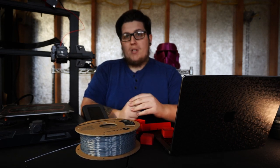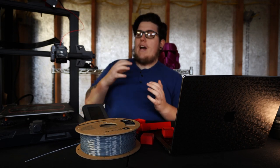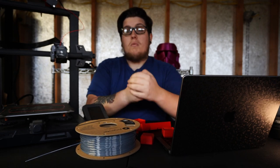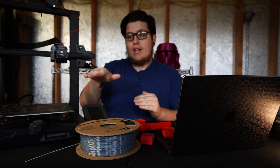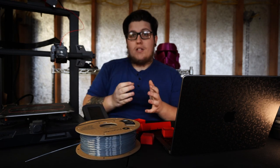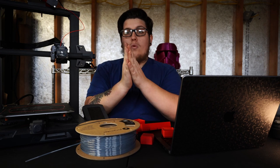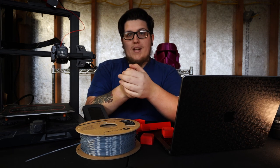When I'm shopping for a machine, I'm looking for: do I like the extruder, do I like the hot end? Does the machine have any other perks like automatic bed leveling, where the machine will actually go around and probe different points on the bed to generate a mesh? Automatic bed leveling is a bit of a misnomer - most machines are not actually leveling the bed, but generating a mesh where the print head will move up and down slightly to account for any warps and deviations. Do you get a filament runout sensor that lets you know when you run out of filament mid-print? These are amazing, especially if you go with a larger machine like the Artillery Sidewinder X2. Now we're going to dive into the computer and do some machine browsing to see where I'm getting this information.